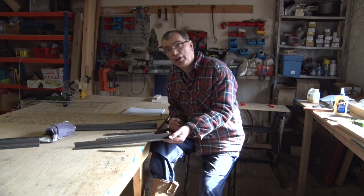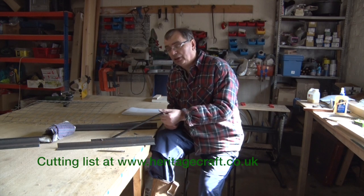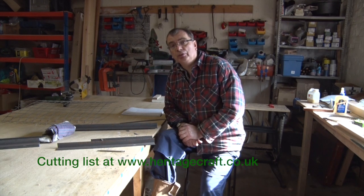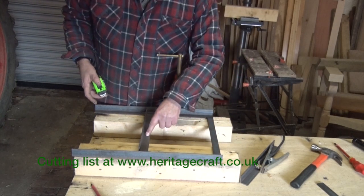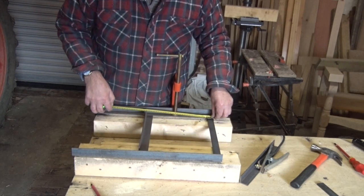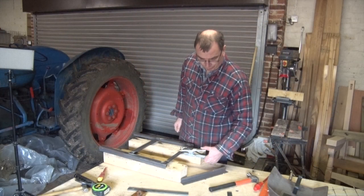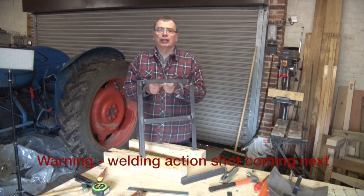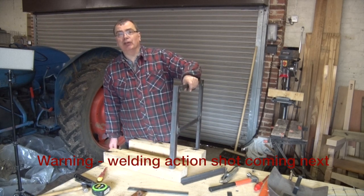I've cut four pieces of angle iron at 500 millimeters long, four pieces of angle iron at 328 millimeters, and four pieces of flat at 328 millimeters, and I'm going to quickly weld that lot together to make a box. As you can see I've welded the first flat piece in across the top and now I'm putting one of the angle iron pieces in — this needs to be 283 millimeters from top to bottom. So here we are, that's the first frame made. We just need to make another one like that and then join the pieces together, and that's the basis of our fire basket.